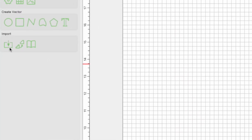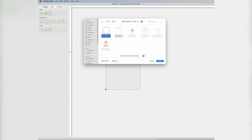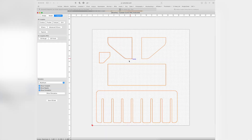No matter which place you've chosen to download the file from, all you have to do is go to the import tab and click that. If you download it from CutRocket, you'll see the C2D file and you can open that up. You can also import SVG or DXF files into Carbide Create the exact same way. As you see here, I was able to import this file and then you can tweak it and delete things that you want or don't need. A lot of times these toolpaths aren't set, and that's where you'll have to do the work — but you've saved a ton of time because now you have a basic footprint of the file. That's what I like about getting those files from Etsy or CutRocket or my website, because we put them there as well.